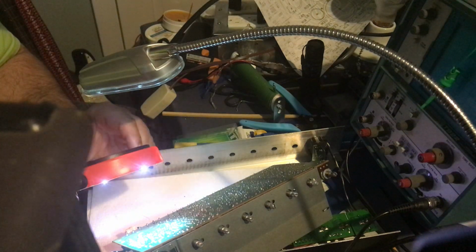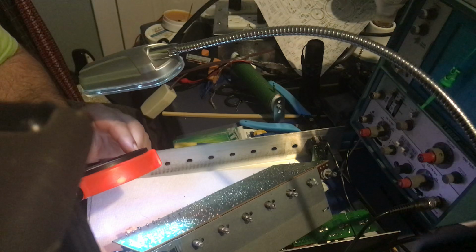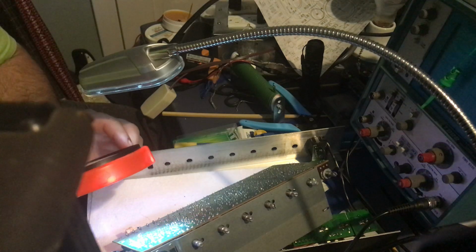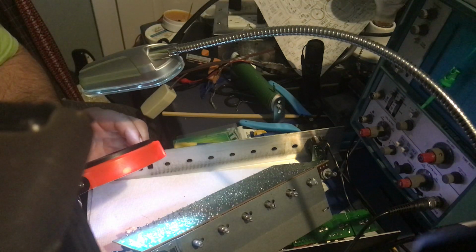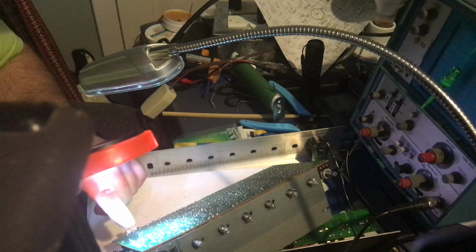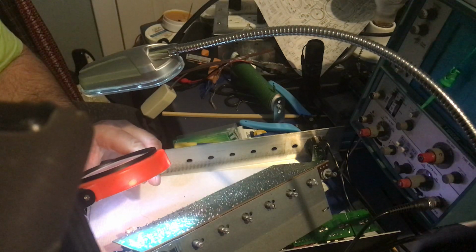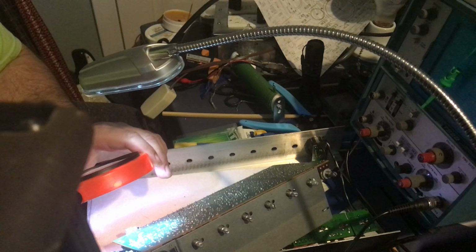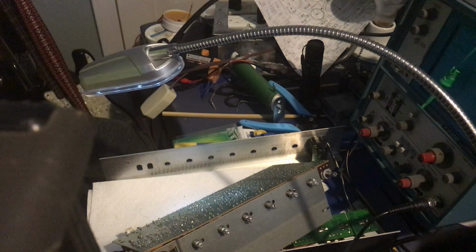It's an annoying little bit of flux there. Hopefully it's flux and not a short. Although no, I see this discoloration around several of these things. And hopefully that's not evidence of the board going conductive. I wish I could show this better. It's like a light brown. Kind of interesting. But these old boards, I'm seeing this umber in between traces. Like here, I see this umber. That might not mean anything, I'm not sure. But it's not flux that I left.